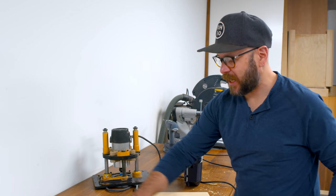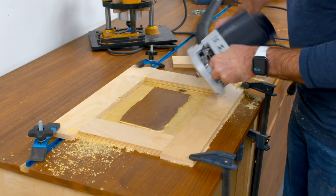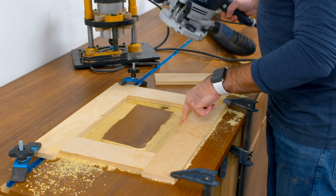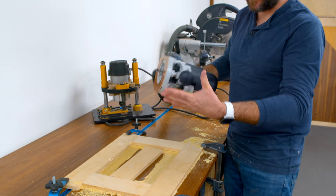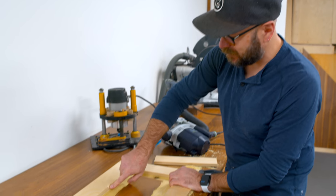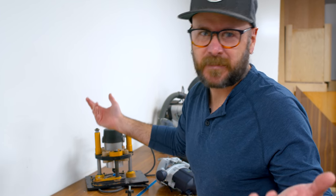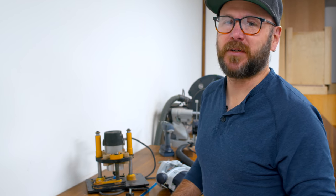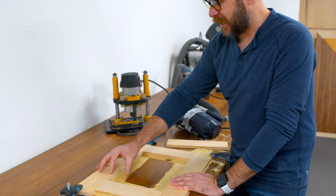I've got my first pass. I don't have to do the whole thing because we're going to take a jigsaw and cut that out. What I found was I didn't have support on this side and the router would tip, so it kind of dug in in a couple of spots. I took this piece of scrap and put it in the middle to give me support on all sides. You can also make a bigger base — I just wasn't thinking. It did end up eating into my template a little bit. It's shop furniture — I mean, it is walnut, but it's shop furniture. So now I'm going to raise the bit and do a second and final pass along the edges.